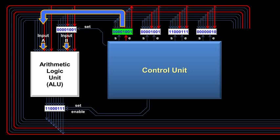As we saw earlier, the control unit knows what operation to tell the ALU to perform because of the instruction it receives from RAM. The instruction itself is in another register called the instruction register. The input wires from the bus won't affect this register, since the instruction was already saved in a previous step. This register, like the temporary register, also has no need for an enable wire, since it just outputs to the control unit.